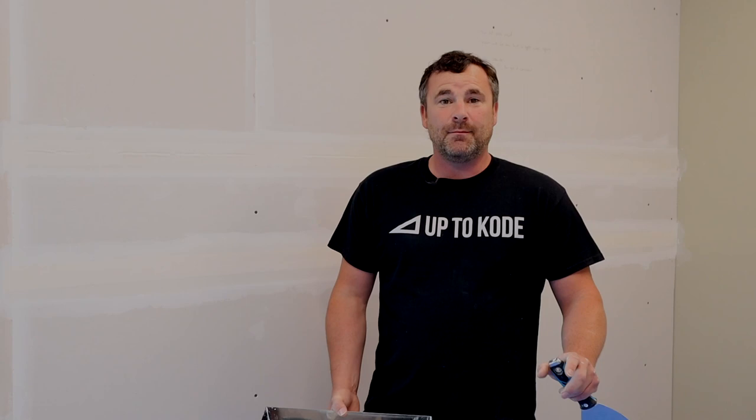Before you start slinging mud, it's always best to pre-fill. I have a video on 10 renovation drywall tips that shows you how to pre-fill. This is the difference right here — this joint I pre-filled, this one I didn't. It's fine, it's just got some bubbles that'll dry and pull back later, but that's the difference.